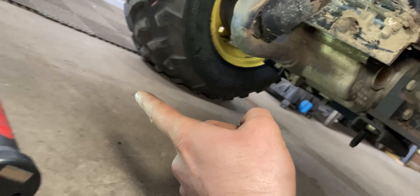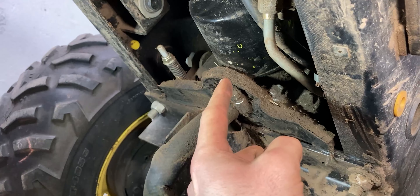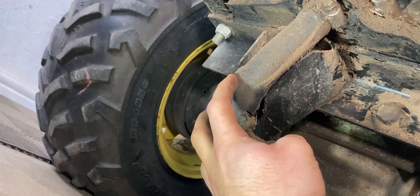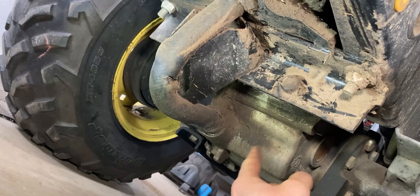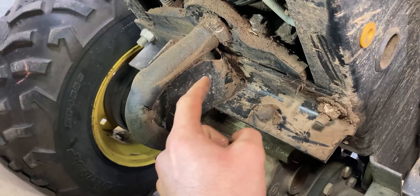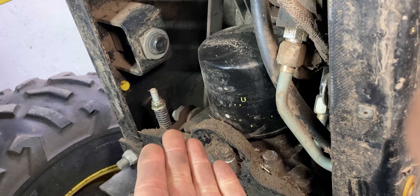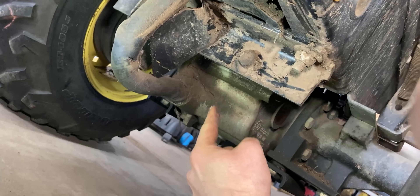I have a work light set up underneath the John Deere 332. This is the hydraulic line pickup that goes into the hydraulic motor — it gets filtered before it goes into the motor. I noticed this hydraulic line is actually cut on one side and there's also a little bubble right there on the hose, so I'm going to be replacing this hose very soon. On the John Deere 317 and 300 there's actually a hard line in this area, so I'm not sure if this is original. I'm also going to replace the hydraulic filter — it's probably pretty old and nobody has changed it recently. I'll drain the hydraulic fluid from the rear end while I'm at it.